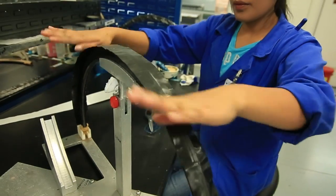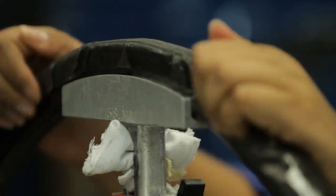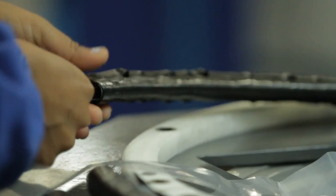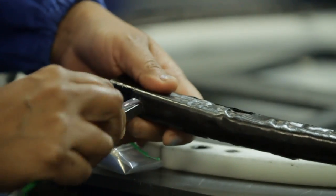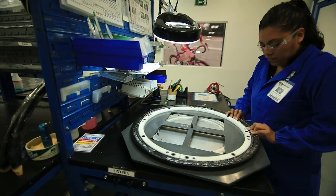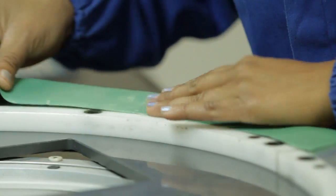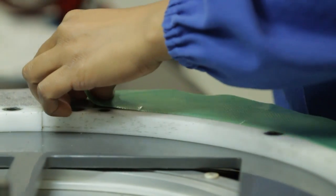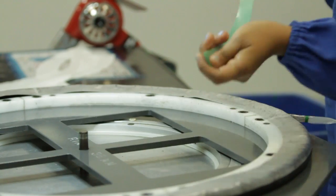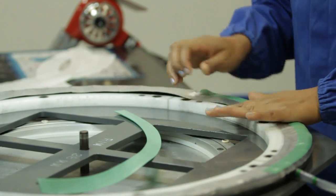Once the two workers have finished the pre-form, it's going to go into a freezer. Once it comes out of the freezer, the latex has shrunk enough that you can pull the pre-form out from inside that half of the rim. After the pre-form has been removed, the bladder gets threaded through the entire rim and the two halves are joined together. The final pieces of laminate are applied, making the two halves a complete pre-form. There's still some plastic on the outside of the rim for protection, which gets pulled off at the last minute right before setting into the mold to keep it free of dust or other contaminants.